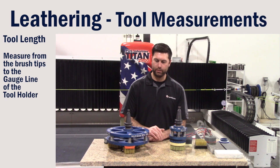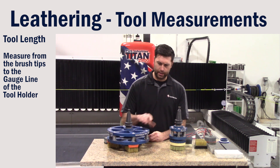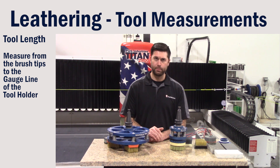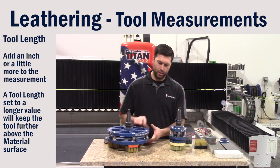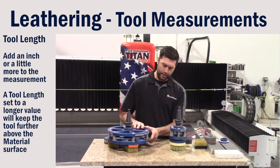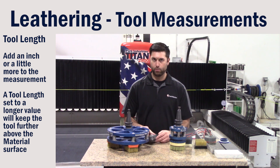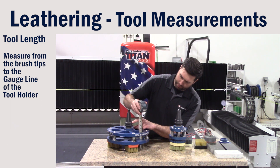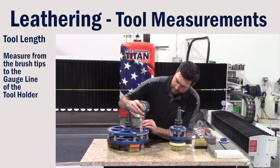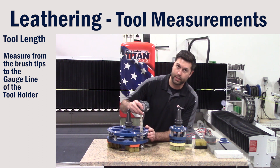The next thing we can look at is building our actual tool length from the tool library on the machine. We can grab a tape measure for the time being. What we're going to do is create a longer tool length and put the tool into the measures, so we can properly set the correct depth or pressure against the actual springs on these tools. I'm going to reference off the gauge line on the actual cone — it measures about seven and a half inches, but I'm going to purposely raise it up and call it nine inches for the time being.